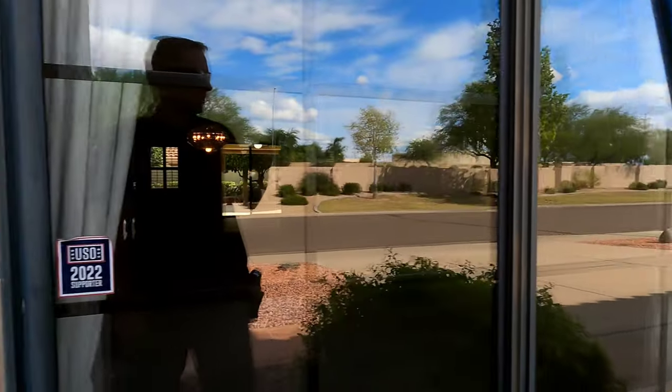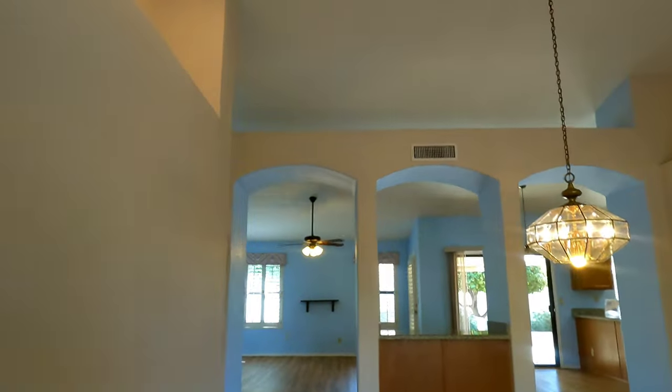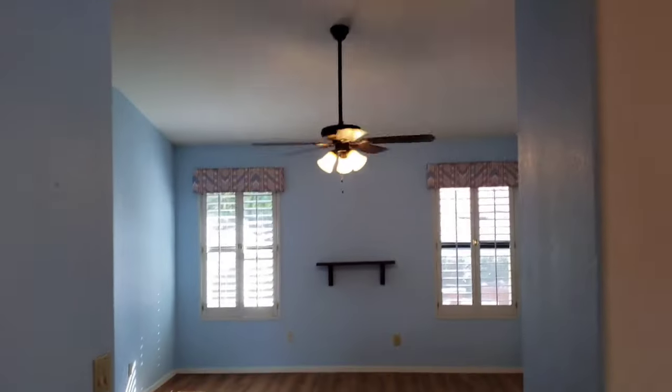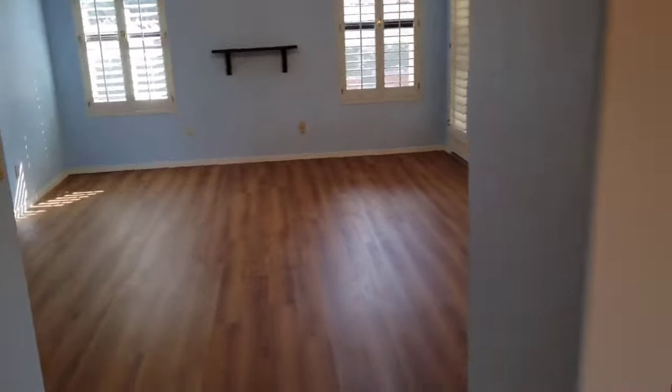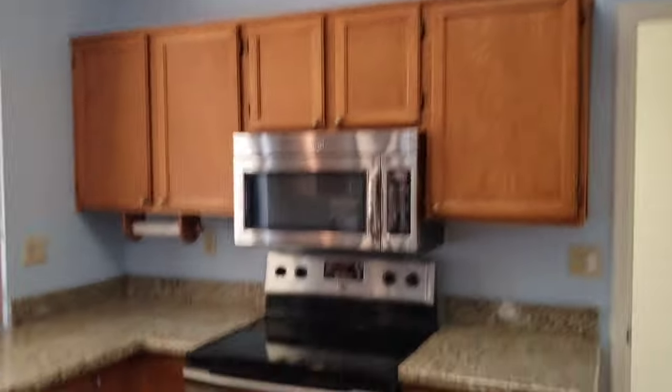Let's go inside. Inside the house there's a little hole in the wall and some cracking up at the ceiling. This is actually associated with a structural issue - there's a truss up in the attic with some movement in the truss work over that area. The truss should be replaced or repaired first, then address the ceiling. This house really reminds me of my grandma's house - it's got a little bit of class to it, bright blue kitchen.